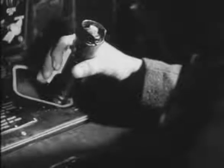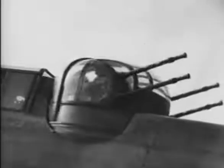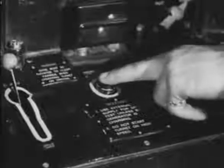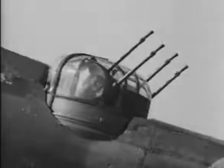By grasping the control column and armature switch lever, he is able to move the control column in all directions. The airman is thus assured that the turret is indeed rotating. Turret movements are tested under power. The airman also tests the high-speed movement by depressing this high-speed button whilst the turret is on the move. This high-speed movement is only intended for a quick change over from one direction to another. It does not improve the motor and should not be maintained for long periods.